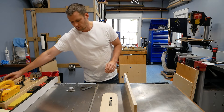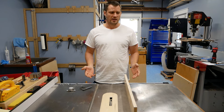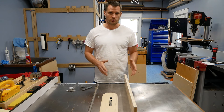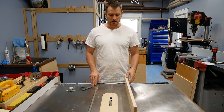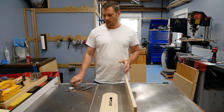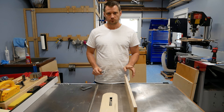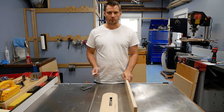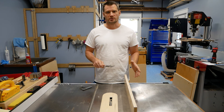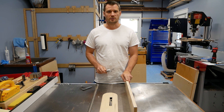So that's just a quick little trick that I like to use when I'm doing these dados. Also pay attention: if you're getting your plywood from multiple suppliers, or even from the same supplier but a different batch or manufacturer, the plywoods can be all over the place. When you're building cabinets, make sure to test with your dial calipers exactly how thick your plywood is, account for that in your measurements, and try to batch whatever cabinets you're building with the thickness of the material that you have. Hopefully that's useful for anybody out there making cabinets or using dados in their workshop.